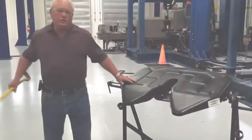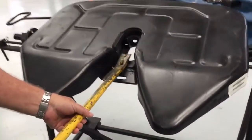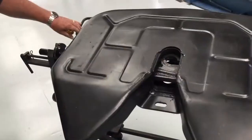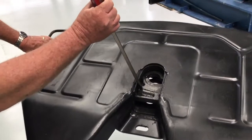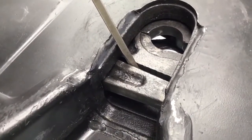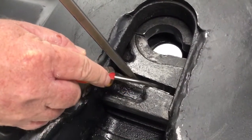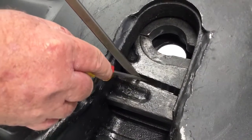First, trip the fifth wheel to the closed position without a kingpin. To do this, take a large pry bar and push the bumper off the bumper seat. Then take a large screwdriver, pull on the handle a small amount, and shove that screwdriver between the two locks. Then take a small screwdriver and pull it along between the two locks to either hear or feel the serrated teeth.